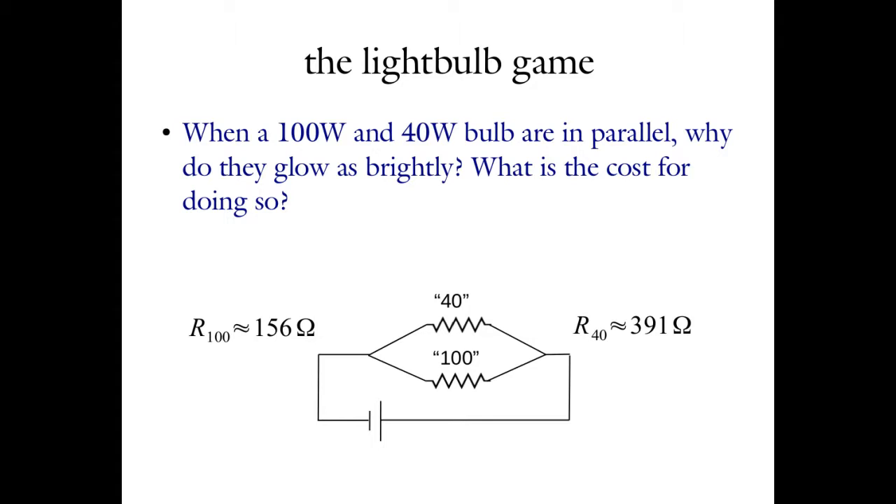When you put them in parallel, they glow just as brightly as they would if each were hooked up individually — you get a nice bright 100-watt and a softer light from the 40-watt. The meter here is set up to measure current in amps. This is 1.18 amps going into the circuit from the wall. I've put the ammeter in the circuit so that current must flow through the meter before it gets to any of the bulbs. It's now in series with the bulb system, measuring a total current of about 1.18 amps through this entire circuit.